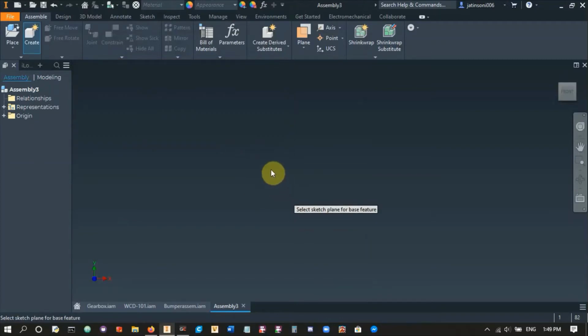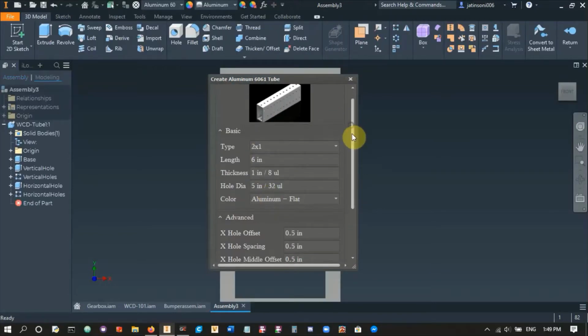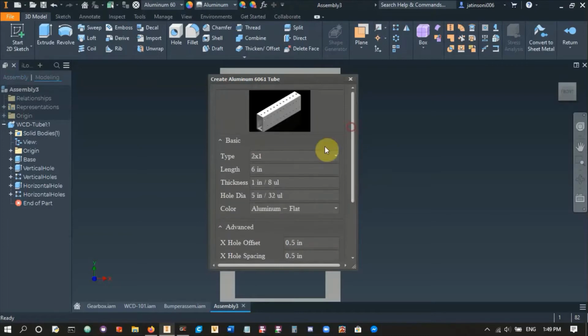And so the way I've set up my template is basically it creates this form. It's called form. And you can select settings here. So I want a 2x1 and I want it to be the length and the width of your drivetrain, right? That depends on each game and the robot. So typically, the rules have a restriction on the frame perimeter. Basically, that means all these 2x1s that we make for the drivetrain have a perimeter around them, like the rectangular frame itself, and that has to be a maximum. That can be a maximum 120 inches from previous years' games.